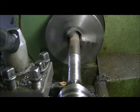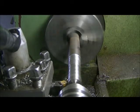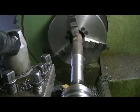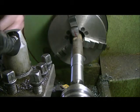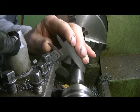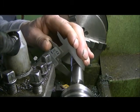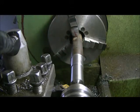This will be one of our last cuts here. I think we're taking 10 off here now, so that should probably leave us, I don't know, somewhere 17 thou left to take. Okay, we'll see what we have here. Should be around 800 thou. 800.5. Yep. Okay.